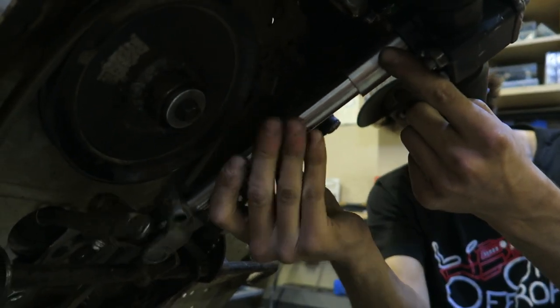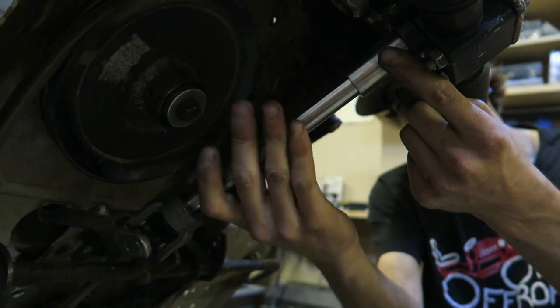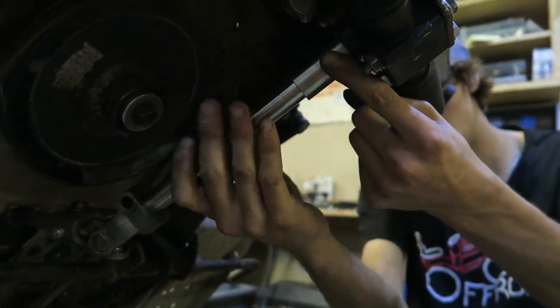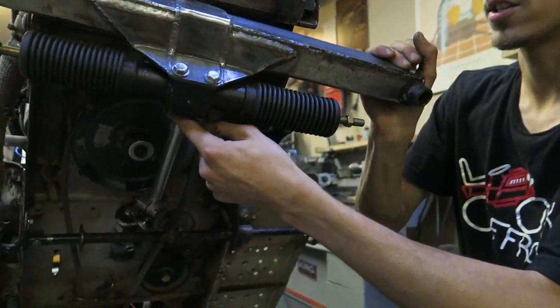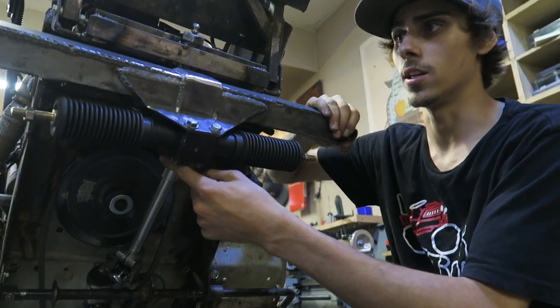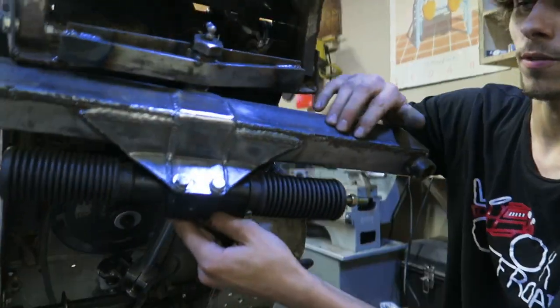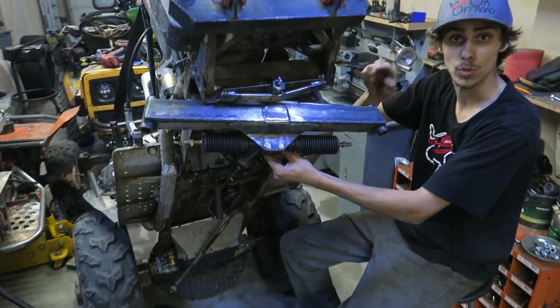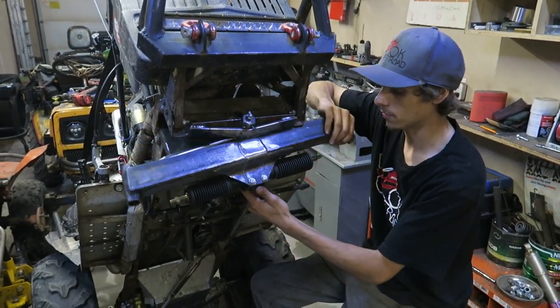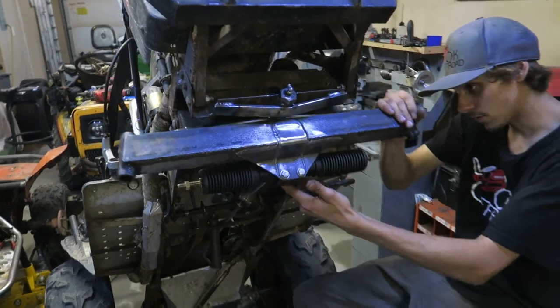So obviously so smooth. Not connected fully to the steering wheel until we put the other top lock screw in, but holy, there's gonna be no binding. This isn't full articulation. We still gotta add a little bit of articulation into here by grinding out the front axle a little bit, because we got some protruding bolts on the backside. But yeah, you guys can still see that it does still have flex here, but it doesn't affect the steering.